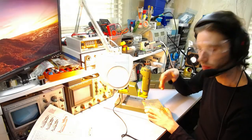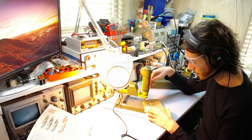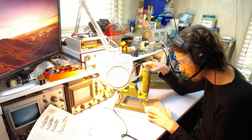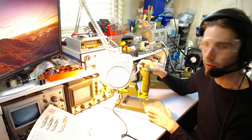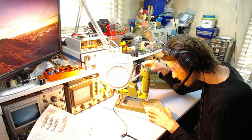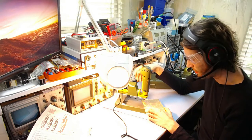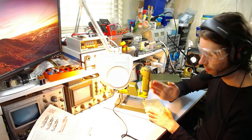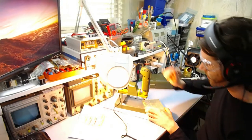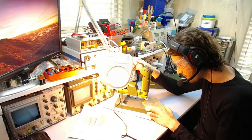If you have etched your board with the drill holes etched in the copper, then you get a sort of pilot hole to start with, and you get an idea of where to bring the drill down. Make sure you get that fairly accurate, because if you are using a really thin drill bit, like 0.5 or something, and you get the hole off and it drags it to one side, it's quite likely to snap. So you don't want to do that, but yeah, I'll just do this with this.